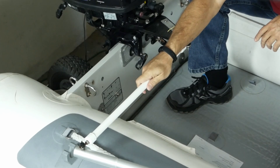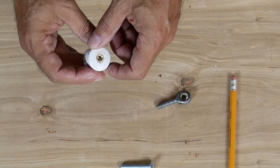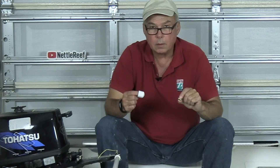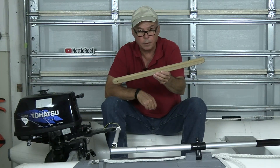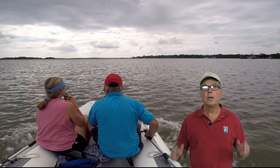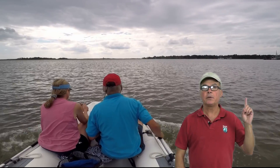I'm very pleased with the way the PVC tie rod came out, but screwing the threaded inserts into the PVC end cap was more challenging than I expected. The inserts are designed for wood, and PVC is a much harder material. If I were to do this again, I would heat the end cap up in boiling water to soften it before screwing the threaded insert in. Or I'd just make the tie rod out of wood or another material. This project is a success. I hope you enjoyed the video — please give it a like and subscribe.